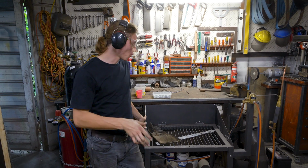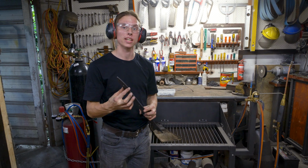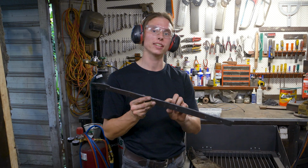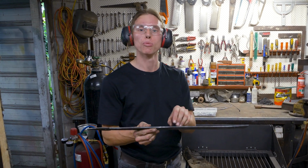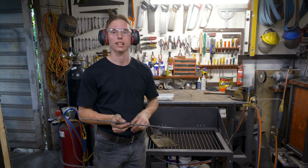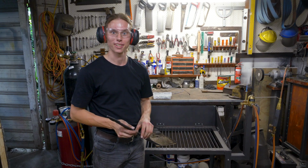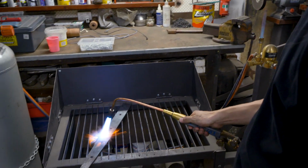While I've got most of the forging done with the coke forge in terms of getting the shape of our pieces, twisting the bars that will be supporting the brackets, when it comes to bending them, we're going to use the oxypropane torch because it enables us to heat the area more precisely. Yes, you can do that with the coke forge, but the oxypropane just lets us get that spot exactly where we need it so we can bend this to 90 degrees and install our bracing. Once the bracket's done, let's heat it up and give it a benderoo.